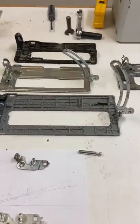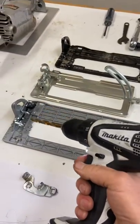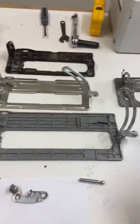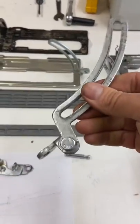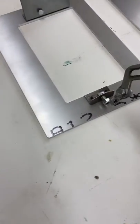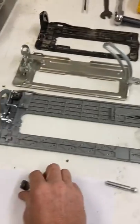First step is to take off your existing table, then with a cordless drill and a three-eighths bit or so, drill out the cherry rivets that free up the riser and the pointer, and then bolt them to the swing table with the three bolts provided.